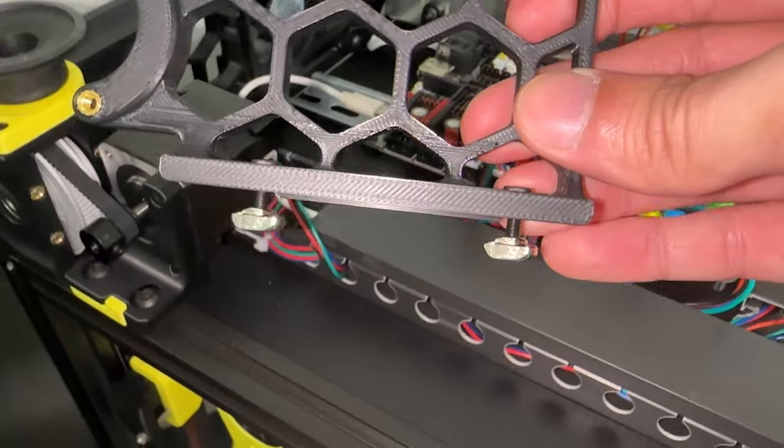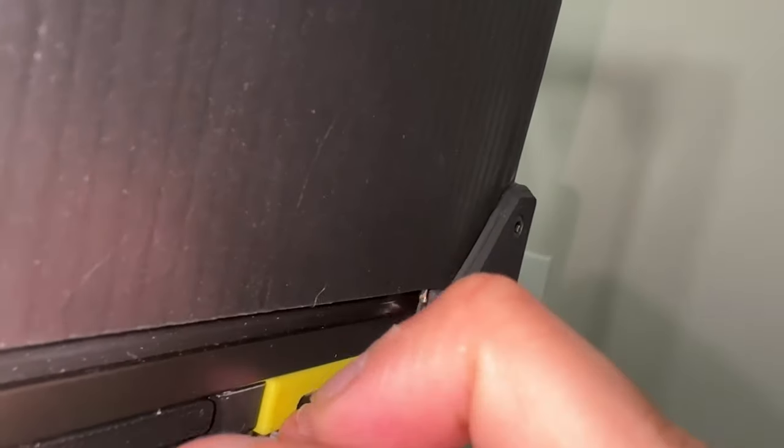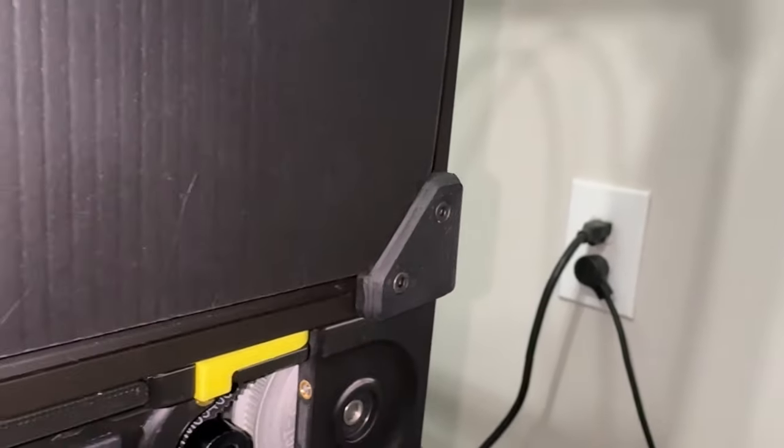If you have trouble with T-nuts, attach them to the screws first before mounting. A small thin flathead can be used to manually rotate and lock the nut in place. This saves a lot of headaches trying to chase it.